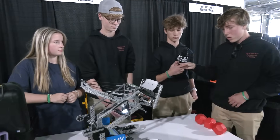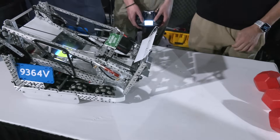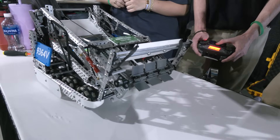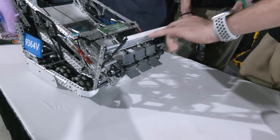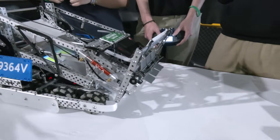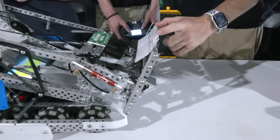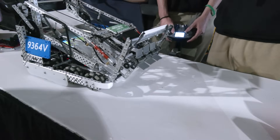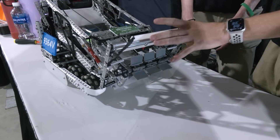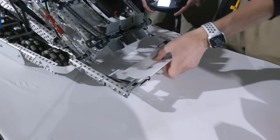Joe, let's talk about your match loading system and the flaps you're doing differently from other teams. We did a lot of prototyping. One of the first things we tested was the standoff mech that a lot of teams were running — a standoff across with high-strength shaft collars and standoffs coming down. The biggest problem was it didn't have much forgiveness; you had to be dead-on in the middle for the balls to come out cleanly. So we designed a Lexan piece and found the balls slid in really smoothly. Henry tested it but it still didn't have the give we wanted at different angles, so we increased the sizing and added these bands so it can flex when the robot drives into the match loader.